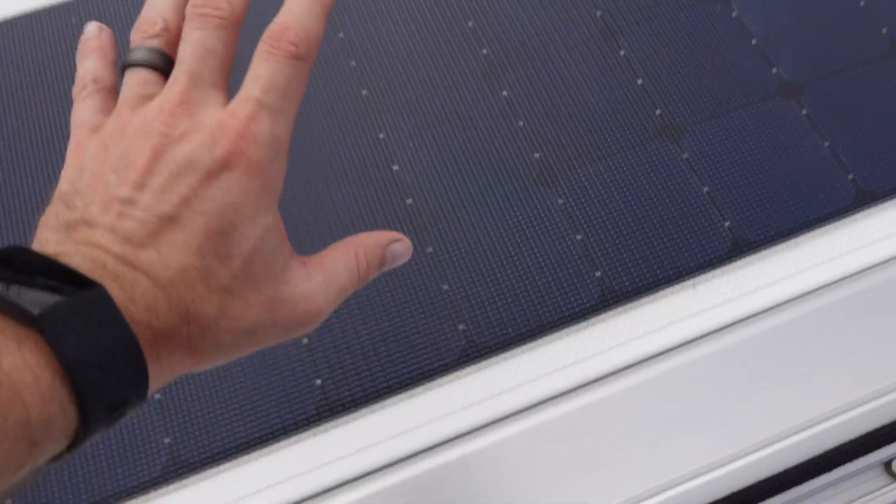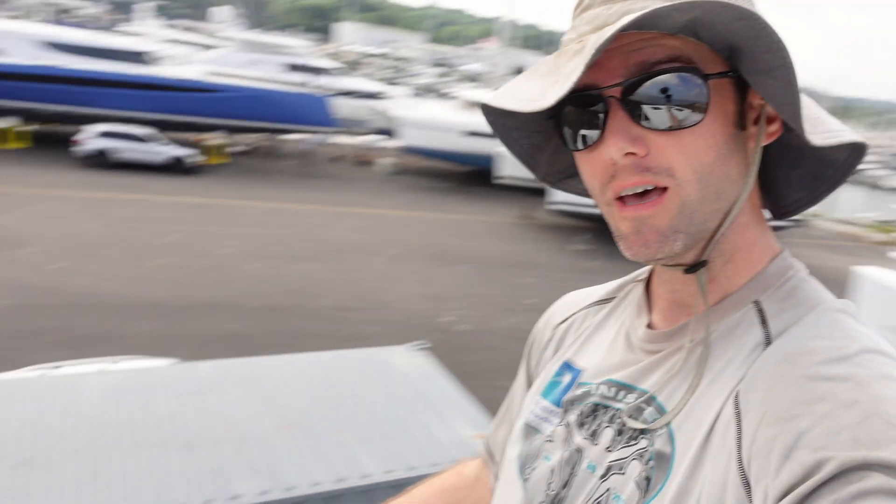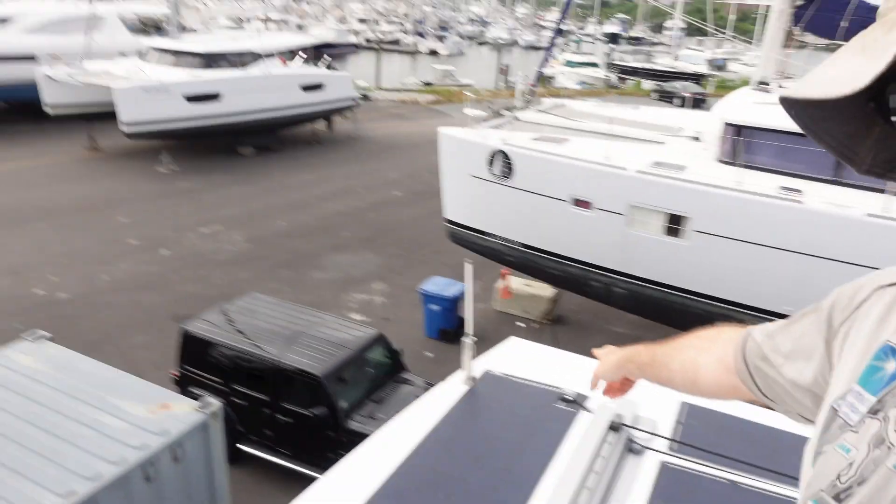So back to this panel — I'm going to move it forward of the traveler. That is going to be underneath the boom normally when we're sailing, so it's not the ideal spot; there'll be a bit more shade. But I've got the solar panel, so why not keep it? Because the electrical cable coming off that panel is shorter, I'm going to have to get a little tricky. We're going to use the longer cable that runs all the way, and we'll redo the wiring down to the solar controllers. It's going to be a little complicated, but I think I've got it all worked out.